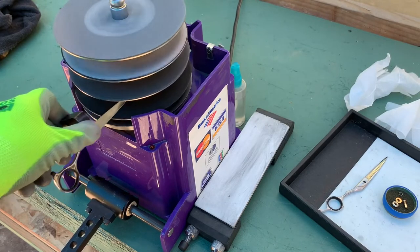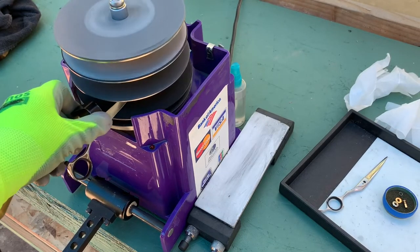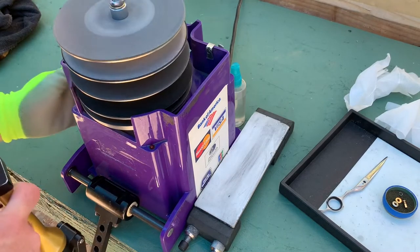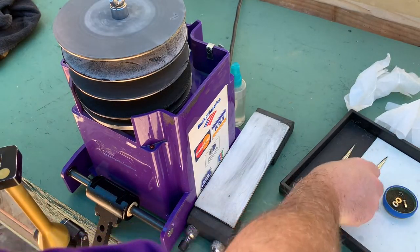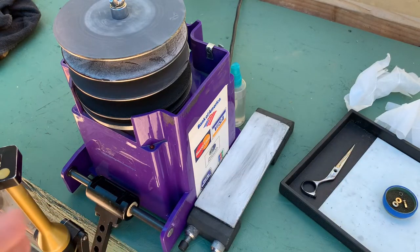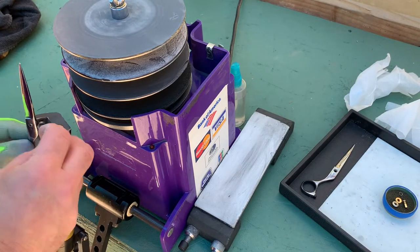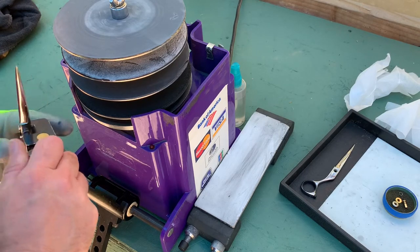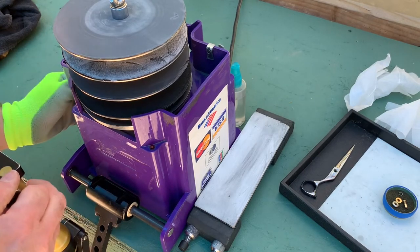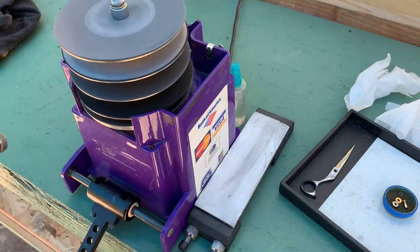And here I am just now buffing. The bottom end on here is a diamond paste. I actually have diamond paste. It's got a little tiny piece of diamonds in it. Tiny, fine dust of diamonds, if you will, which polishes the metal, the rough surface from my sanding on the grit, to bring some shine.